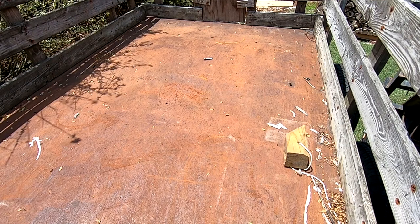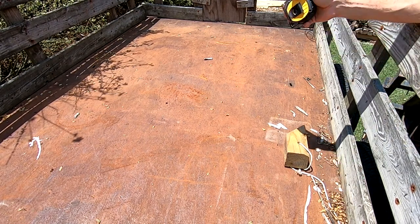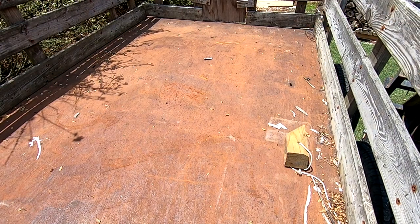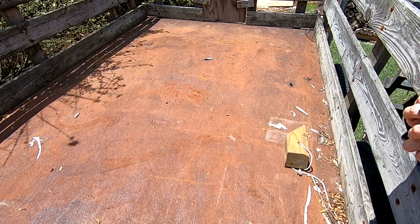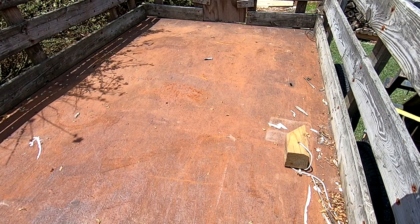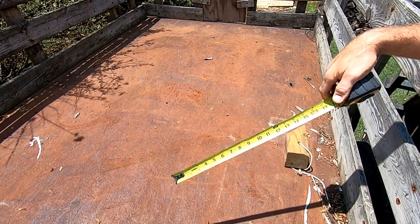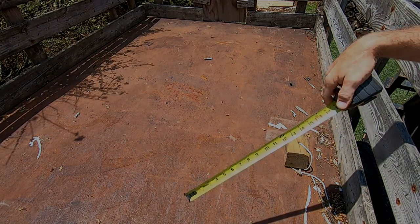So what I have, I'm going to tear this thing down to the bare frame, and then start mocking up and building at least a 2 foot. Is that a 2 foot? All right, and then we're gonna put a 3 foot dovetail on this guy. So then, what else we gotta do? Oh, and we're gonna take these perches off of the 2 axles, and we're gonna move them back because we are gonna be adding some more weight in the rear. So let's get this thing in the shop, start stripping it down and throwing some sparks.